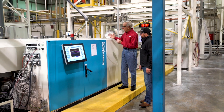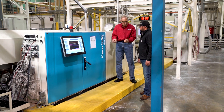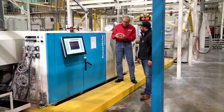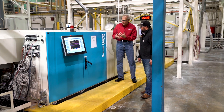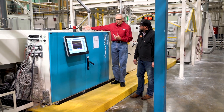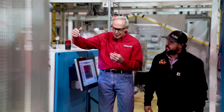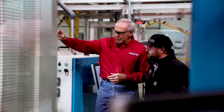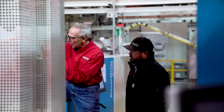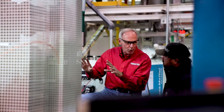Now we're at the line. What we have here is our extruder. Picture inside this extruder two screws counter-rotating in opposite directions, taking that powder, the re-grind, and the foaming agent, and blending it into a taffy. As the process continues, the screw geometry changes. It goes through a process of removing all the impurities in the vacuum. This is the final stage of the screws doing the final mixing of the material before it gets to the sheet die. At the sheet die — the coat hanger die — the material has to go from this little nozzle and spread out over about 57 inches. Another art in the whole process.